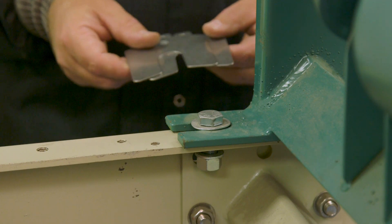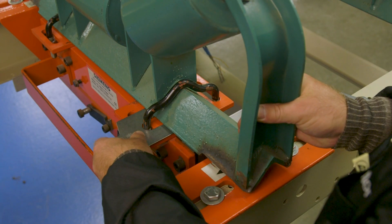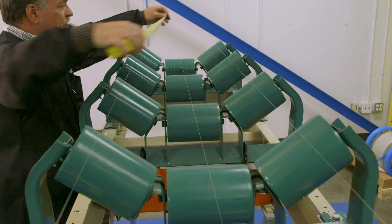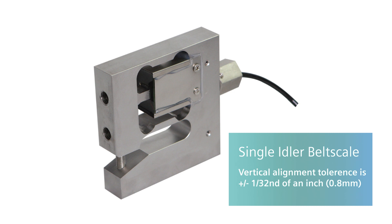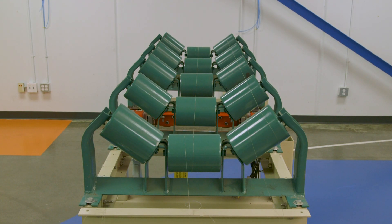Alternatively, Siemens offers a belt scale installation kit. When placing the shims under an idler, use two shims of the same thickness under the mounting foot to ensure the idler is being raised straight up. When shimming the scale, we have a choice to raise the entire scale or to raise the scale-mounted idler only. During the alignment process is an excellent time to ensure that the idler spacing is all the same for a minimum of two spaces before and after the belt scale, and that all of the idlers are parallel to one another and square to the frame of the conveyor. The tolerance value for the vertical alignment is very tight because the deflection of a load cell is very small. The tolerance is plus or minus 1/32nd of an inch for a single idler belt scale, and plus or minus 1/64th of an inch for a multi-idler belt scale. Poor idler alignment is the number one cause of non-repeatability and inaccuracy in belt scale applications. Taking time to do a detailed idler alignment right the first time will ensure that your system is delivering as expected.